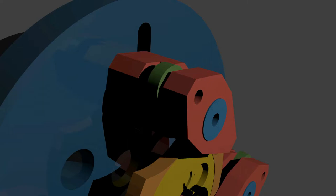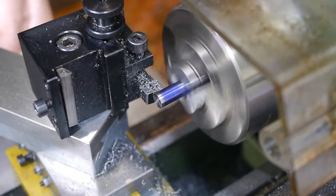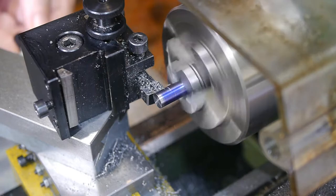Secondly, I needed to ensure the shaft at the back of the jaws is coaxial either side of the thumb wheel. This shaft controls the orientation of the top jaw, so any inaccuracy will cause the jaw to be misaligned. I was remaking the scrap parts from scratch, so I decided to completely rethink my approach.